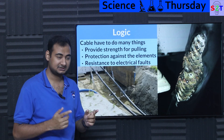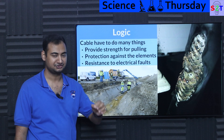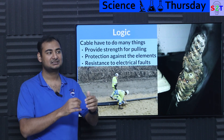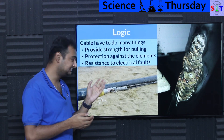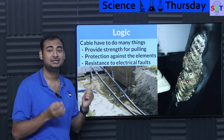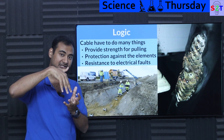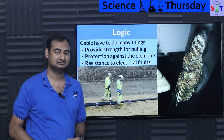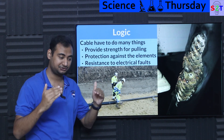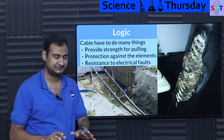It should not go boom. At high voltages, you do not have a spark — if you have any malfunction, you have a boom. Normal sparks might have a one megawatt flash pulse, but these cables have one megawatt continuously running. So an arc flash could literally vaporize the teeth off an excavator bucket going near it — that's how powerful these things are. So it has to be able to fail safely and handle electrical loads calmly.